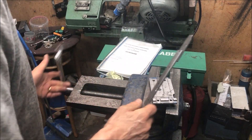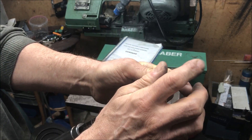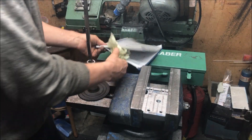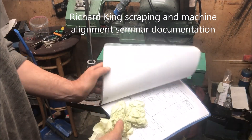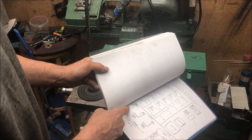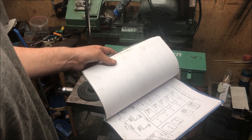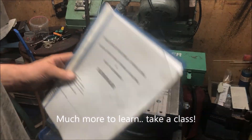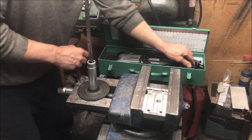I thought I'd pull up both a hand scraper and a power scraper. This blade needs to be at a different angle — a cutting angle that is not radius — and that's where expertise comes in. Looking at my notes about scraping soft steel: rough scrape from zero to 20 degrees positive. The same information is also in the Biax documentation, so having read that, I also have to prepare the Biax.